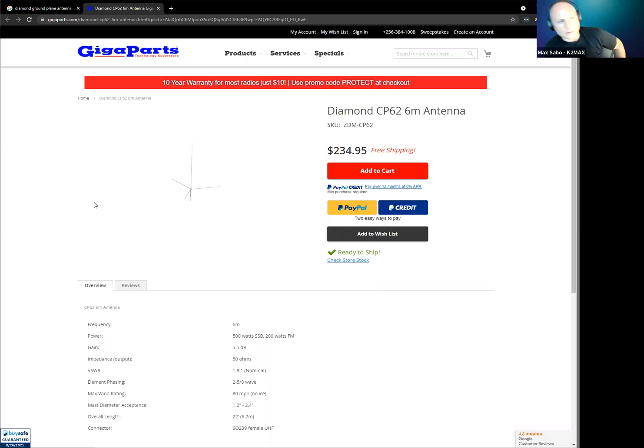You probably don't want to put a lot of RF energy below it, but if you have gutters or other metal pieces, the antenna typically or realistically does not see any of that. So that's one good thing to keep in mind: if you're attaching this to your roof, if you just get it a few inches above your gutter line, that's actually perfectly acceptable.